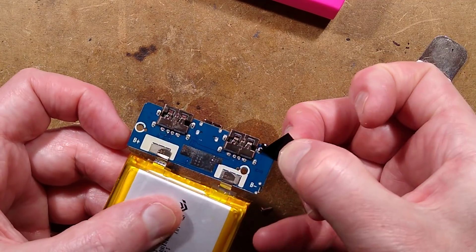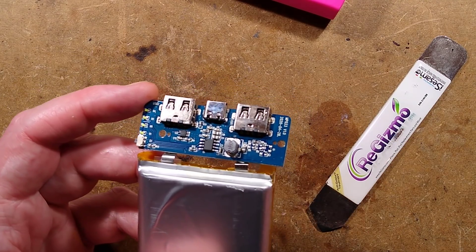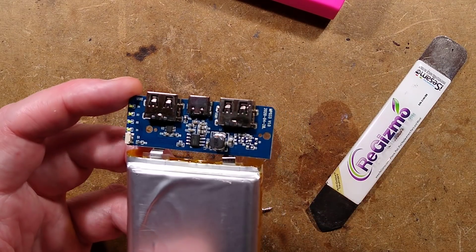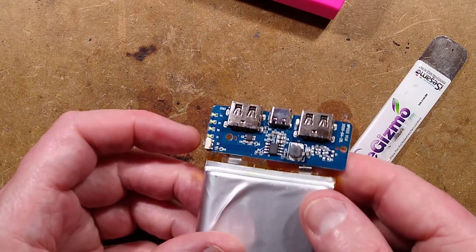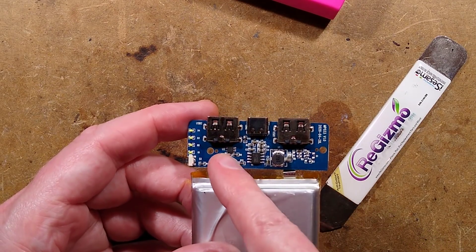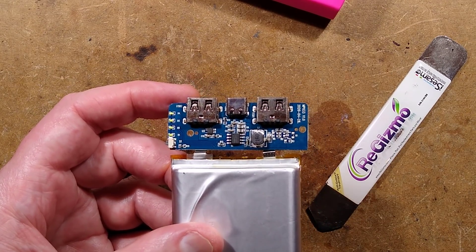Let's take this thing off. What is the circuit board revealing? It's revealing a little 8-pin chip, but it's a dedicated switching 8-pin chip - that is an interesting component. Next to the negative connection I'm guessing this might be a hybrid DW01-style battery protection chip. I'm going to get this circuit board off and then we can take a closer look at it.